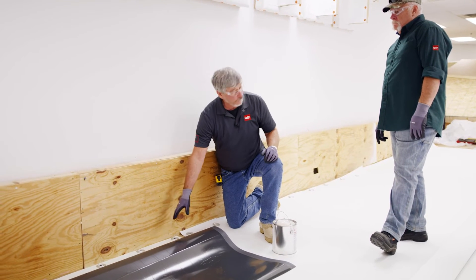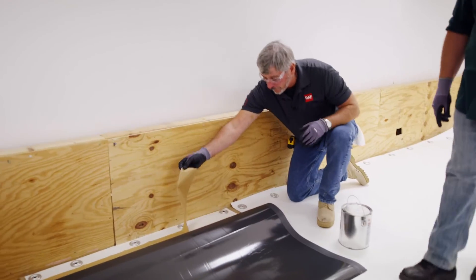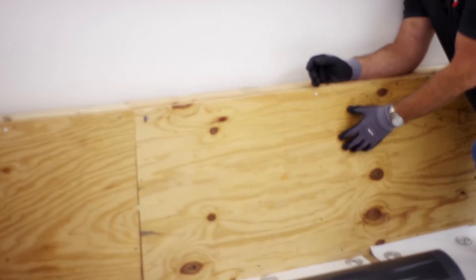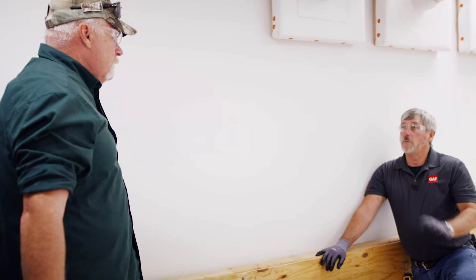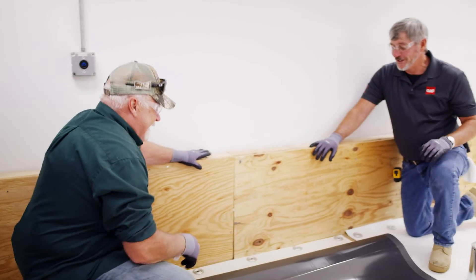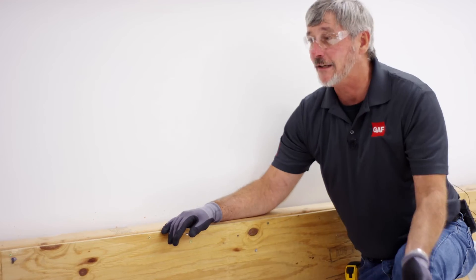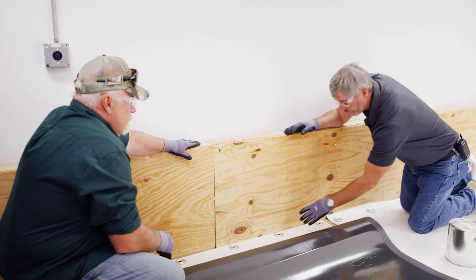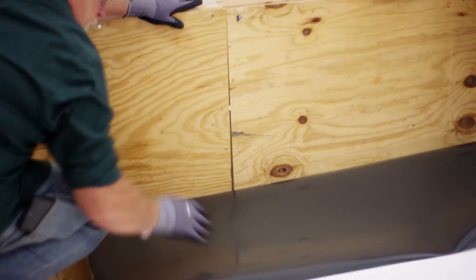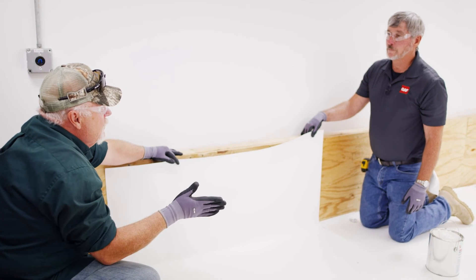You can take the RTA strip up the wall — screw it in — or do it on the flat. Since we have it on the flat here, prior to running the sheet in, remove the release paper — now you have adhesive to adhesive, tape to tape. Take your TPO primer and prime this wall. Don't use solvent-based adhesive, don't use asphalt primer, and don't use the red primer. A lot of guys skip the TPO primer and just glue the walls — it's going to fail long term. Once the primer's on, remove the release cover, dive this over into the wall, bring it right up — that's your one-piece flash.